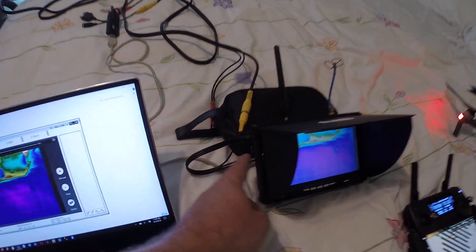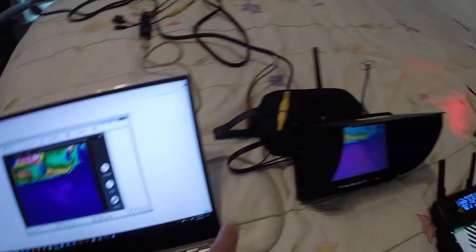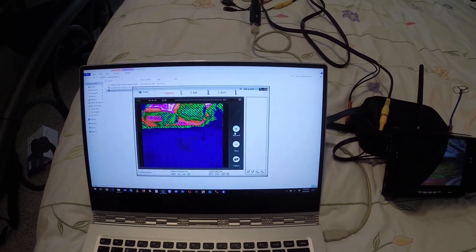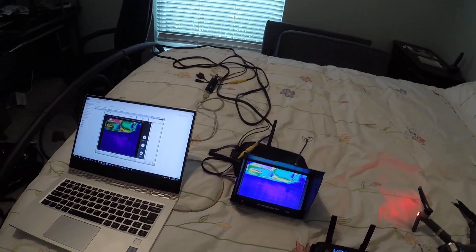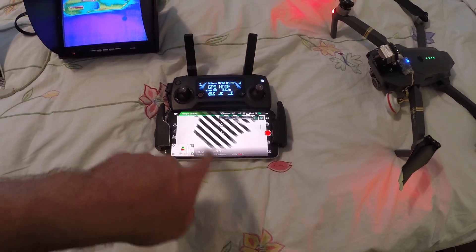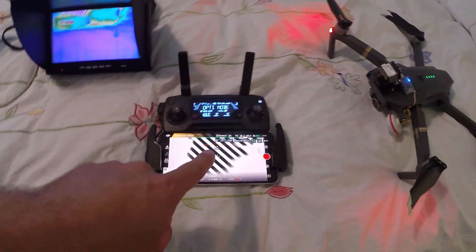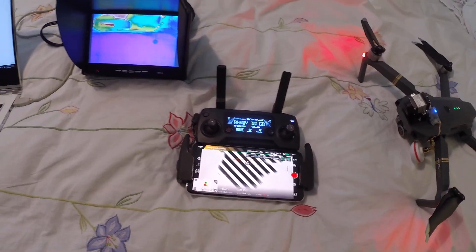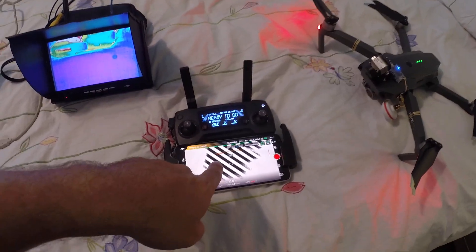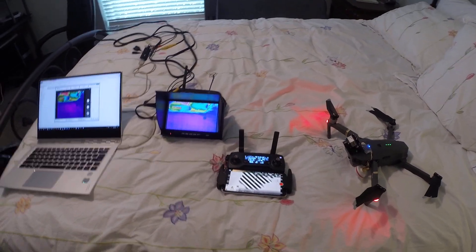Simultaneously, you can record the thermal on an SD card on the side of the screen. You can also broadcast to your laptop — just an export or import into that, using a basic input. You can broadcast in real time, record it, or capture all the data for later. I've also found it useful to swap the cell phone for a tablet and broadcast HDMI out, so while flying in real time I can be broadcasting in 1080p and streaming the thermal signal — all in under 2 seconds real time. I do not suggest the default DJI apps or Facebook/YouTube streaming; I don't find them very effective. Reach out to me if you want more information on how to stream live.